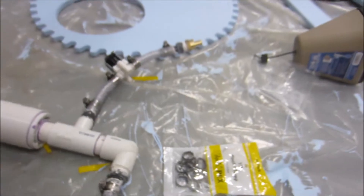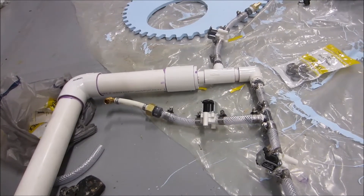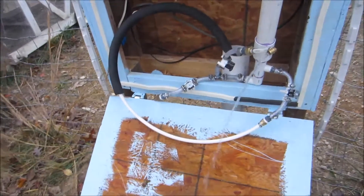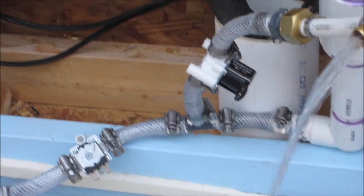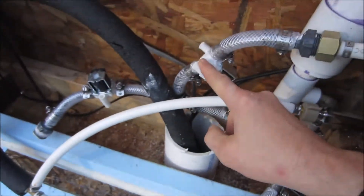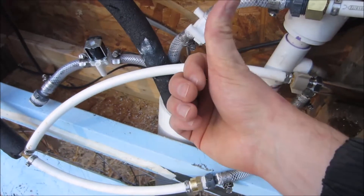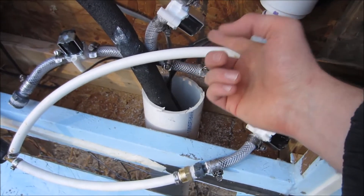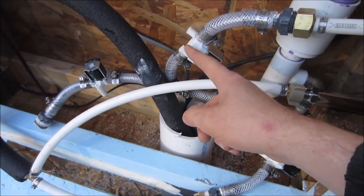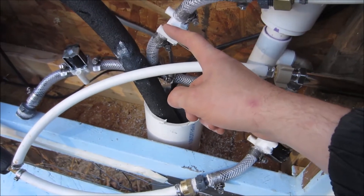My line coming from the pressure tank is probably around 40, maybe as high as 60 PSI. This is kind of a giant failure — these valves are always on, and then when you apply current they turn off, which is exactly backwards from what I need. It turns out the valves have a bias: in one direction water will always flow, and in the other it will actually stop until it's opened. Not all valves have a bias, so that threw me, especially because there's no indicator of it. I figured it out by blowing on one end — it went through — then blowing on the other end, and it did not go through.